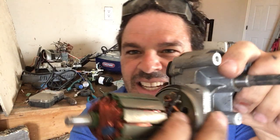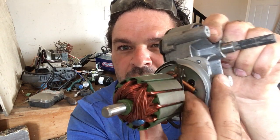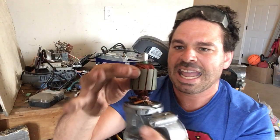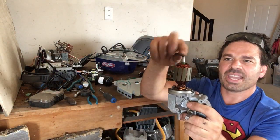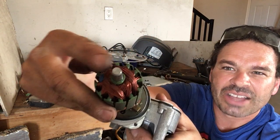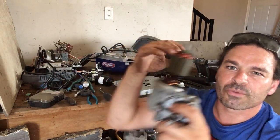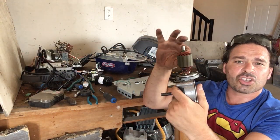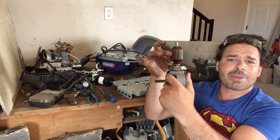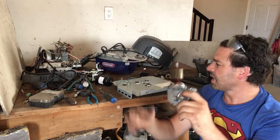There's a screw hidden right underneath that copper spool — I'll remove the copper spool first, then this will pop off. It's easy to remove the big cylindrical piece of steel — that is thicker than a quarter inch so it's classified as steel. That number two copper going for $4.37 a pound is better worth my time and effort. The cast aluminum, once I remove all the magnetic attraction, gets 45 to 50 cents a pound for clean cast — versus copper motor price of 15 to 20 cents a pound if I brought the whole armature in.